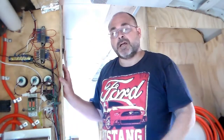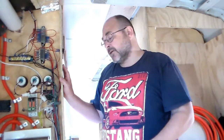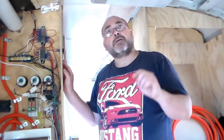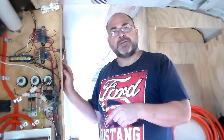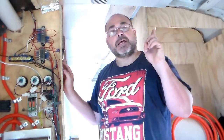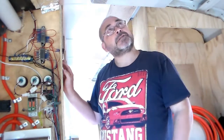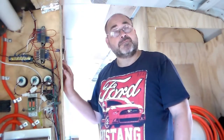That started. Now, I haven't installed a separate soft starter, which people are saying you needed to do. So it's at the lowest temperature, 16 degrees Celsius, on the highest fan setting, started off the battery and the solar, and where I was saying the generator won't cut in until the battery has dropped to 11.7 volts, I've done a couple of tests on this, and every time it has run at 16 degrees at high fan speed for 2 hours completely before the generator kicked in.